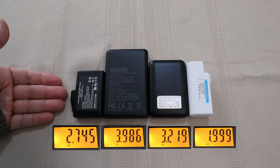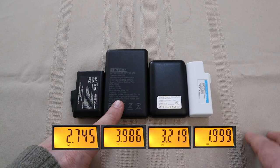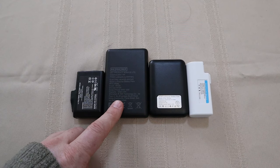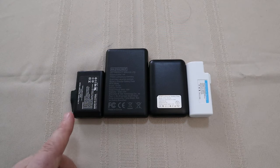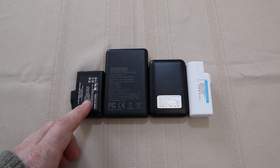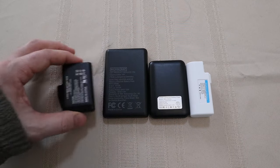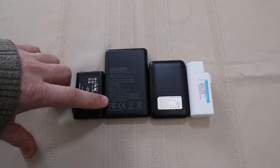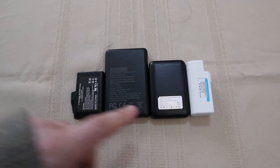Looking at relative pack sizes and weights, the reason the Vice Plus pack is significantly bigger even though both it and Mr. Warm claim 5000 milliamp capacity is that the Vice Plus is the only one that's Bluetooth capable. Also, even though the Snow Deer pack says 2200 milliamp and these say 5000, the packs aren't that much different in size — that's because the Snow Deer is a 7.4 volt system and I suspect these are 3.7 volt. The wattage on them is very similar: 16 watts versus 18 watts.